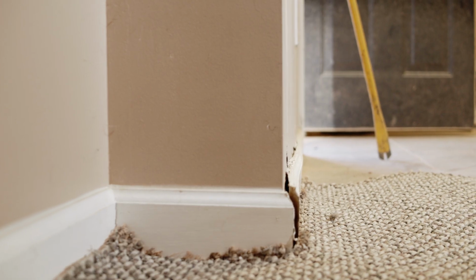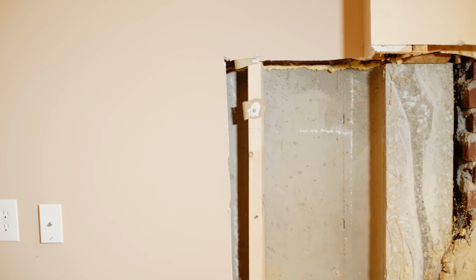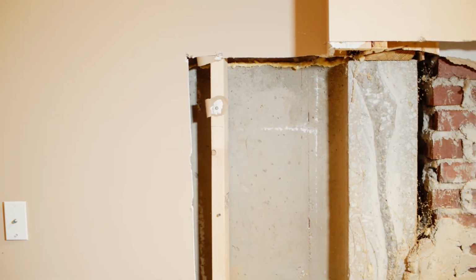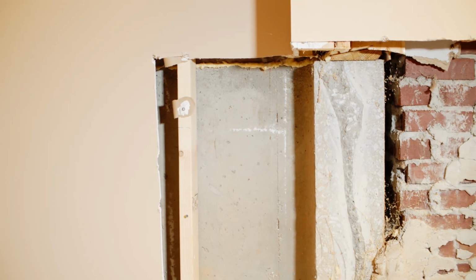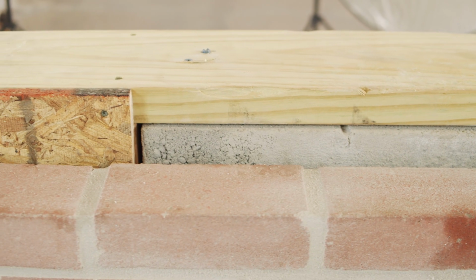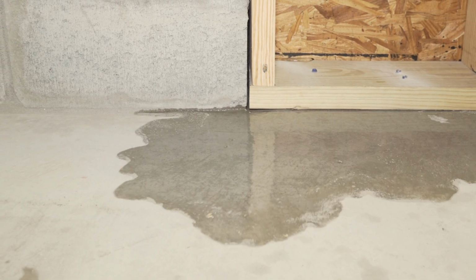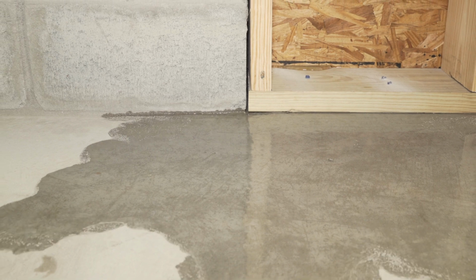If your basement is finished, as in this home, we see the interior walls bump out or L-shape. This is the most vulnerable area where the concrete foundation wall transitions to a wood-framed wall. This is where water in the finger space is no longer held in place by the two walls, providing a weak point for the water to flow into the home.